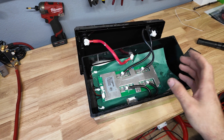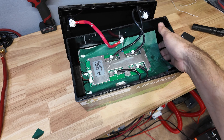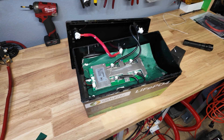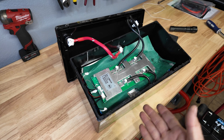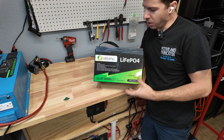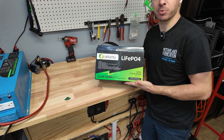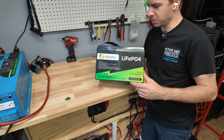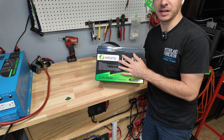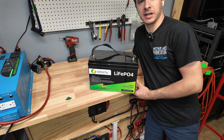This is the first time I've seen this battery design — normally we always have the big square prismatic cells. If this thing had pulled full capacity, honestly with this build quality — the way the cells are secured and the cylindrical cell holders — I would have given it a really good score. But they're advertising it as 100 amp hours and we're only getting 90, which is deceiving. I can't recommend it based on that. If they re-rated it as a 90 amp hour battery at a reflected price, it'd be a different story. Let me know your thoughts in the comments.